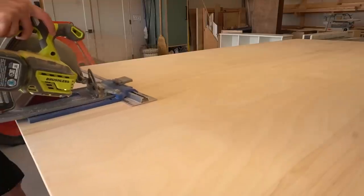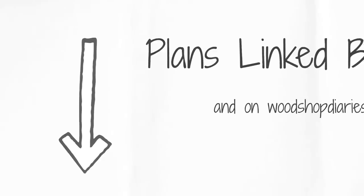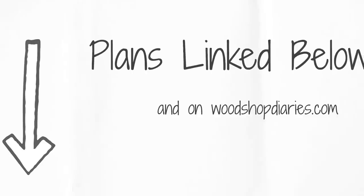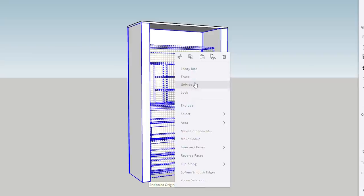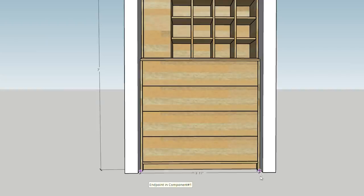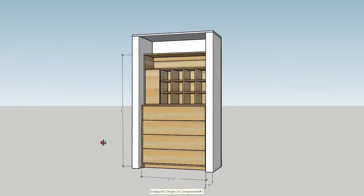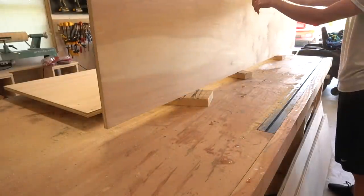The first thing I did was unload the plywood and start cutting it down. I've provided plans and dimensions in the link in the description. This project was designed to fit into a nook roughly 4 foot wide, 2 foot deep, and 8 foot tall. To allow for wiggle room and potentially unsquare walls, I made this 47 inches wide, about 20 inches deep, and about 7 foot tall. Any gaps after installation can be covered with half-round, cove, or some other type of thin molding or trim if desired.